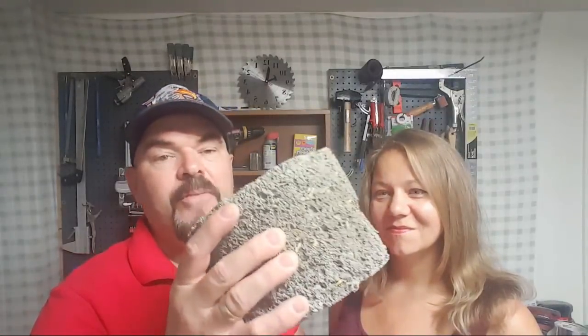I know last week I took this block that is very porous and I poured water right through it to demonstrate how porous you can actually make aircrete. And then I showed you some more dense ones that have a lot more microscopic cells in them, and how water doesn't flow through them easily, but it still absorbs water and whatnot. And how I was going to create the aircrete recipe somewhere in between there.